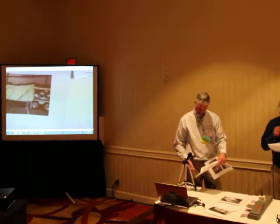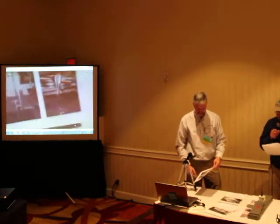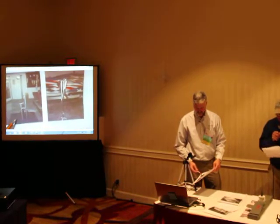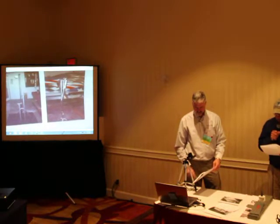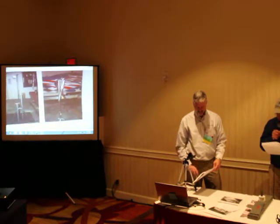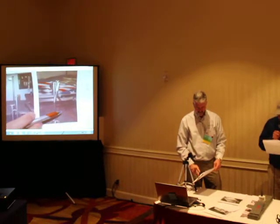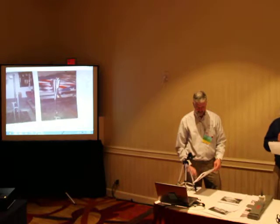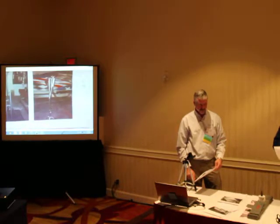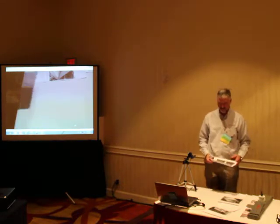And the technical description is, we had an aluminum welder fabricate these stands with his aluminum tube scrap pile. The tripod bases have tightening bolts to hold the top piece in place, much like a set screw, so they can be adjusted to any height we need. We also have several heights of top pieces to use depending on the height of the frame that we're making. The bases are mounted on a board with the help of stands, so we can all build our Biminis on the floor and we don't have to climb up and down on the boat. They also can be used for a number of other tasks. That's the Bimini frame stand number 8.